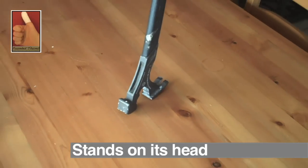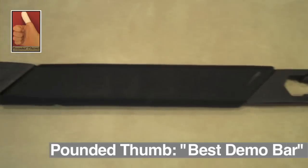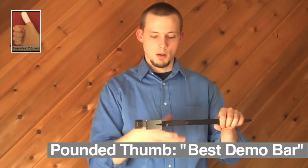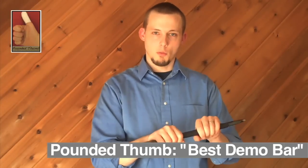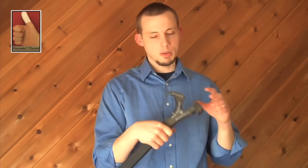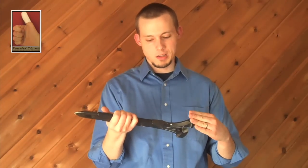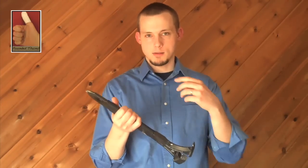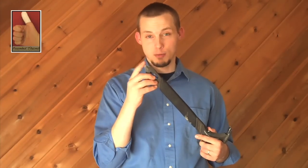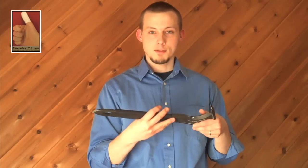In short, the Annihilator is probably the best demo bar I've ever used. This axe head alone, plus the fact that you're grabbing away from the wall and not cramping your fingers into it, really makes this a superior tool. The only downside I might mention is that the hammer claw is not quite as agile as the longer claw you might find on the FUBAR. But if you're going to be busting open walls, this is going to be your best friend anyway. I give this two glowing thumbs up.